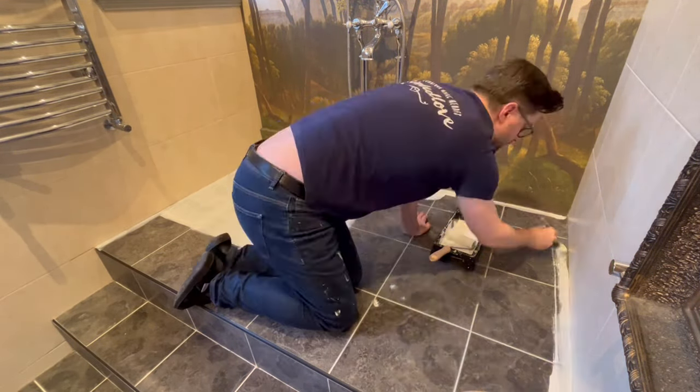The other thing that I've got is my brush that I use for my dry brushing. This is really here so that I can sweep away any debris, any loose hairs, fluff, particles that might be on the floor, because once the lacquer goes on, that dirt or hair will be trapped in between forever, and that will really annoy you. So make sure you've got a clean surface to work from.